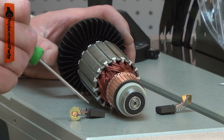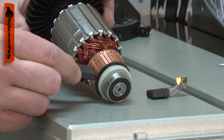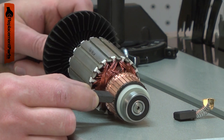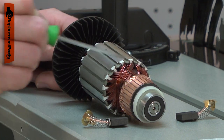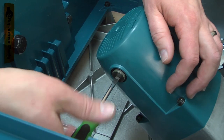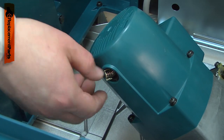Your tool's motor uses two carbon brushes to conduct electricity to the armature. They do this through the commutator. The carbon brush will wear down over time from rubbing against the rotating commutator and will need to be replaced. Worn brushes can cause excessive sparks around the commutator. Sparks can also be caused by a damaged armature, so you'll want to carefully inspect both if sparks are present. Replacing the carbon brushes is a repair that you can do yourself.